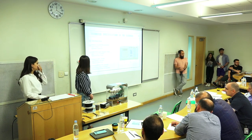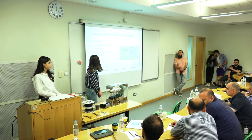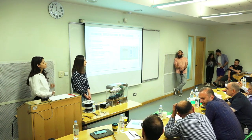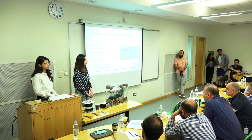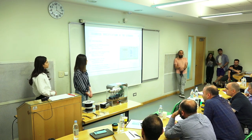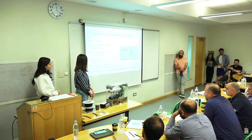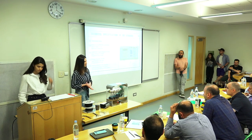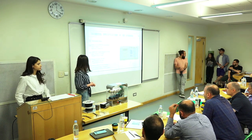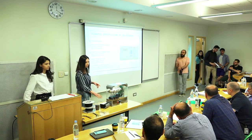And here we have our power supply, as you may see here too. It is a 24 volt DC power supply, and it supplies most of the power needed for our electrical components. And then we have a 24 to 12 volt DC-DC converter, which converts the 24 volt to 12 volt and supplies it to our Arduino and also the cross-flow fan here.